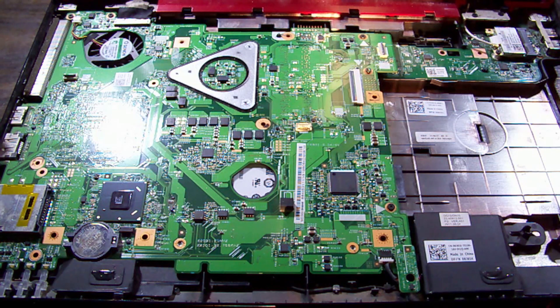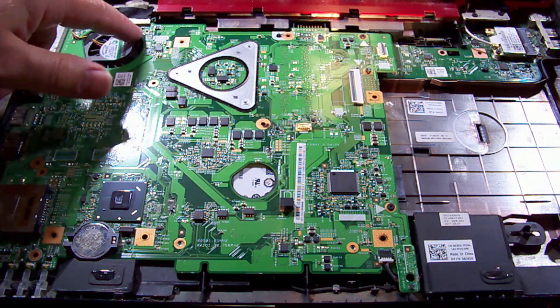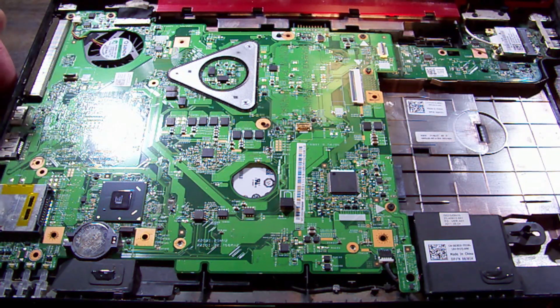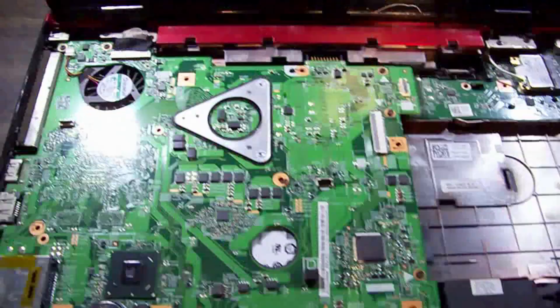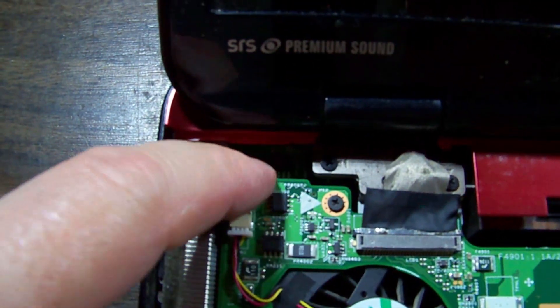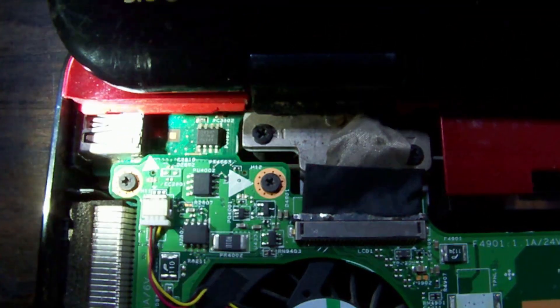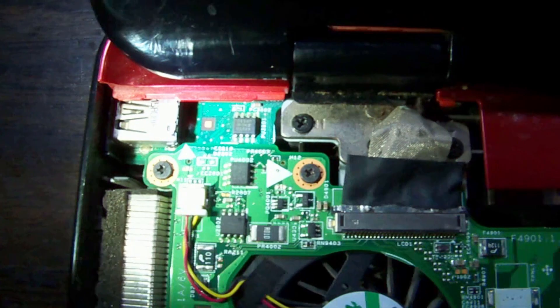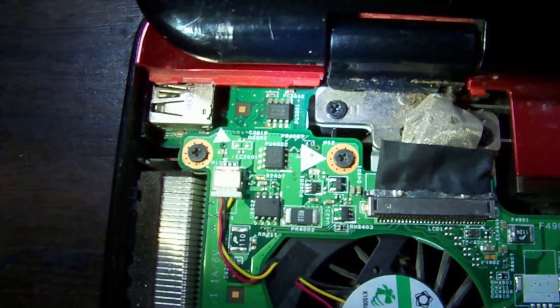She's pretty dusty so I've given it a bit of a clean. There's a lot more fluff under here by the fan — the wads I was pulling out suggest there's going to be a lot more to clean up. The DC-in comes into a little board hiding down in the corner there, and it's got a little pin device on it, so we'll need to take the board out.